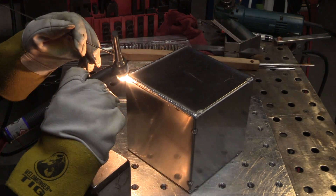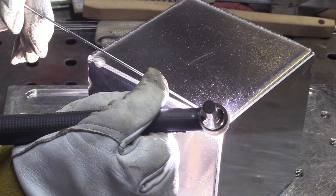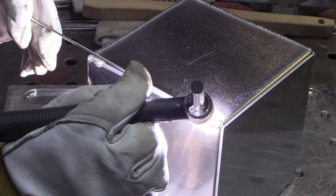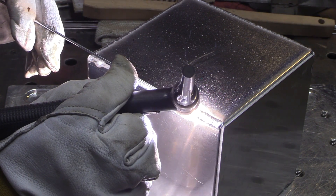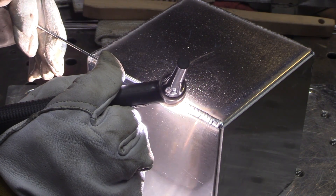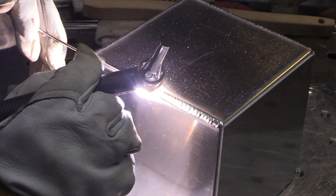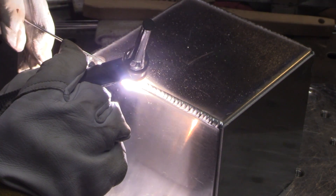In just a few minutes we've got one of these joints with a little gap on it, so that's what we'll use to show some pulse settings and a slightly different technique — just running over the rod. I mentioned I was adding rod about once a second and moving the torch ahead about an eighth of an inch per second. This is a six inch cube, and as I edit this video I can time things — six inches took me 41 seconds; the exact number would be 48 seconds, so I went just a little bit faster.